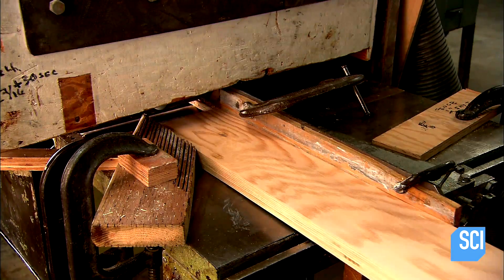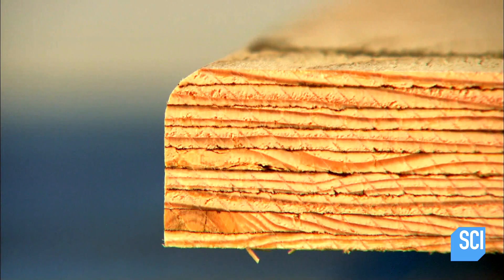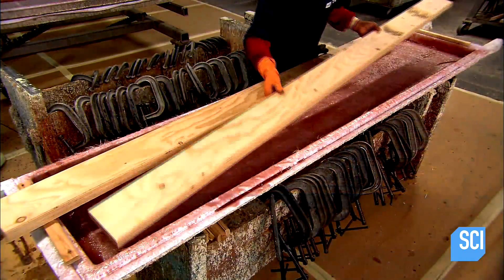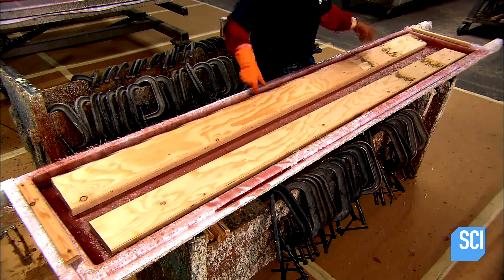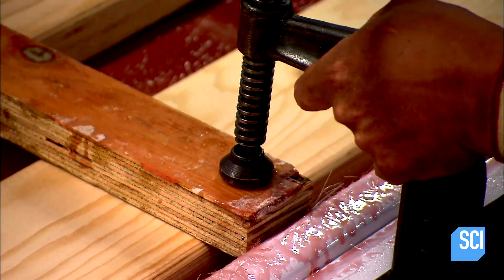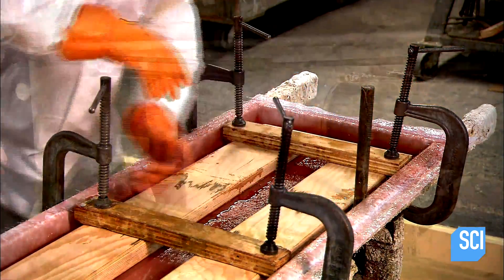The diving board's core is made of laminated wood, which is several thin layers of wood glued together. Laminated wood is actually stronger than a solid piece of wood. After rounding the top edge, they lay two wood laminate cores over the resin-saturated fiberglass mats. They position clamps to hold the cores in place, then let the resin cure at room temperature for a half hour or so.